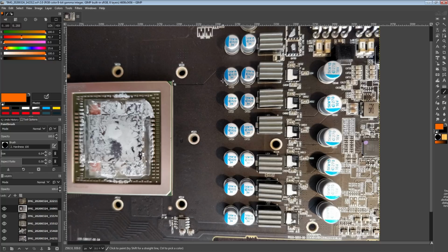There's still 12 of these, right? So you have the same total number of capacitors, but these are just higher capacitance, higher ESR, higher ESL. So basically, Sapphire's capacitor bank is cheaper and slower. That's the main thing: in terms of handling high frequency switching noise from, say, the GPU core, this is just worse.